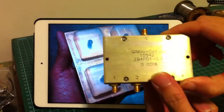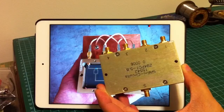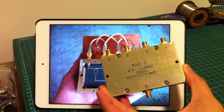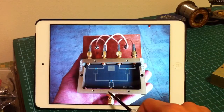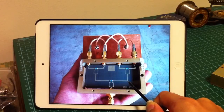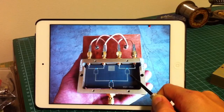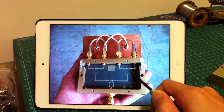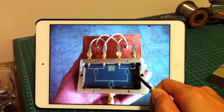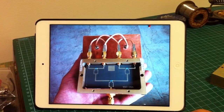It does a good job, but this splitter is expensive and it's heavy. Once the back panel of the 4-way splitter is removed, the inside looks like this. As we all know, every antenna is 50 ohms, so the feed here is 50 ohms. The 50 ohms gets divided into 2×25 ohms. Each 25 ohms then goes through a quarter-wave transformer, which is basically a microstrip of one quarter wavelength at 50 ohms. The transformer transforms the 25 ohms to 100 ohms. The 100 ohms then gets divided into 2×50 ohms, and then we arrive at 4×50 ohms, which are our 4 crosshair antennas.